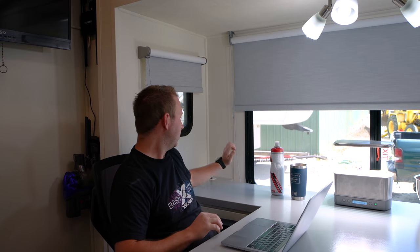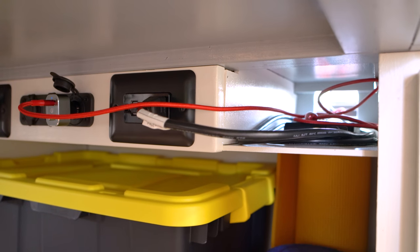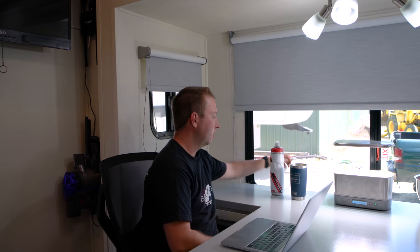Around the edge of the desk I added a 1x2 red oak edging strip to give a much stronger edge. The whole desktop is then painted with a really durable enamel paint, which I think looks really good. We've also got USB outlets in the corners and a cable trough so cables plugged in underneath can feed through and exit out the back. A few little details like that added as we went along have really helped turn this into a very usable desk.